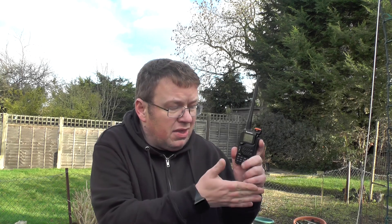Now with all firmwares that you mod on the radio, they are experimental. This week's video, what I thought I'd show you is another firmware I found. It enables TX on SSB, so we can do 2m sideband and we can do 70cm sideband. How cool is that? This radio now goes from 18 megs right up to 1.3 gigs and they can TX on sideband.